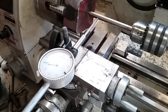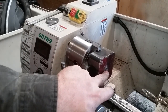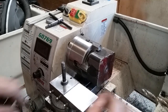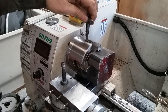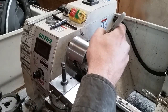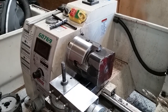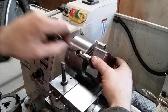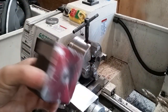I've got about four thousandths runout — close enough. I drilled a 13/32 hole all the way through this thing, and I've got to take this back out. I've got a little piece I've got to weld onto here — that's this dog knot right here. So what I've done is I'm going to mark the two jaws that I'm going to take loose so I can get this back in the chuck the same way I took it out, and get the same jaws back to tighten that I had loosed. That should get us back pretty close to where we came from.